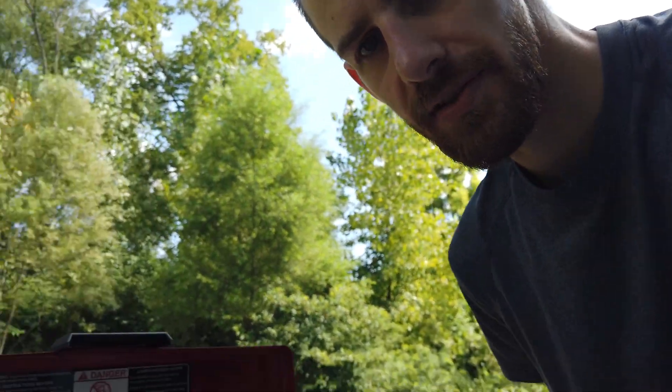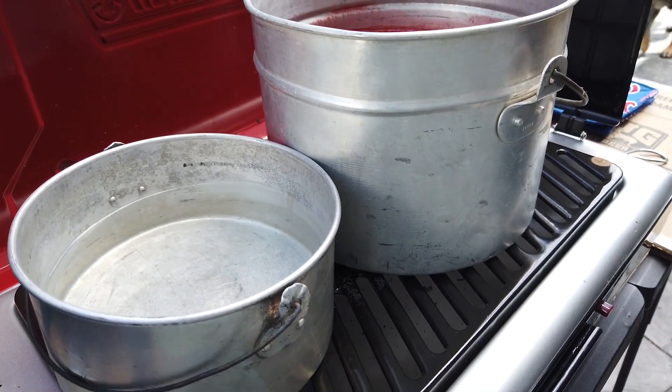Our part's been in the dye for about 12 minutes now. I'm going to go ahead and put on this other auxiliary pan - a little rinse pan with just plain water. We just want this to be a little bit hotter than what we can get out of the spigot. You could totally just use hot water out of the sink, it's going to be hot enough to get the job done. I'm just going to try a little bit warmer because I'm trying to seal in some of this red color. If you're just dyeing parts black, you can go a little bit lower on that rinse temp. Red is not really that easy, so that's what I'm going to try and do.